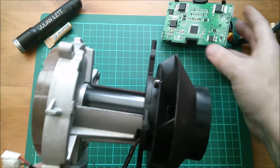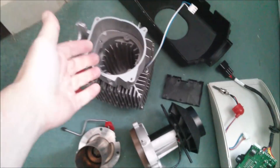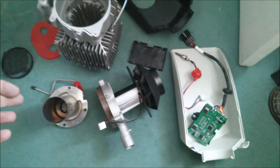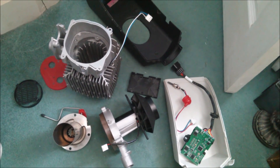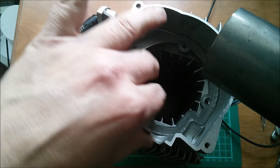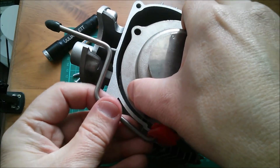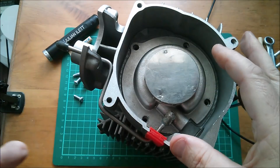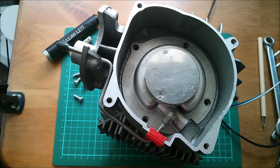So all the parts are here on the floor: the main metal casting with a temperature sensor on the outside, the plastic casing, the combustion assembly with the fuel pipe, and the only moving part — the motor with its two fans. That's the diesel heater teardown. Now I've just got to put it all back together, and the next video on this will be firing it up. Cheerio.